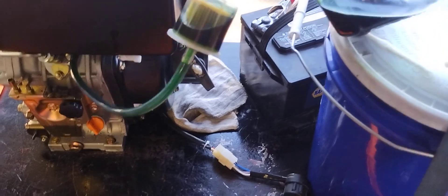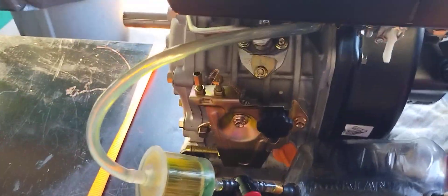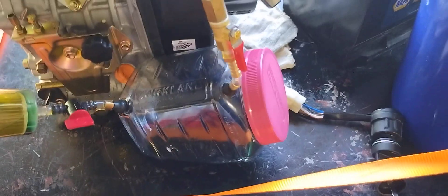Let's show you how I flush the fuel line. Get the tank down here — this is still open. Now we open the diesel line and the diesel starts flowing out. Get that stuff out of the filter, give it a shake. That's about the gist of it. The line is all cleaned out, ready for the next video — easy as that. I unscrew this, dump it into my little cup, and pour that into the big tank.